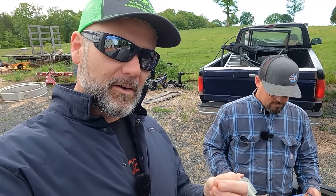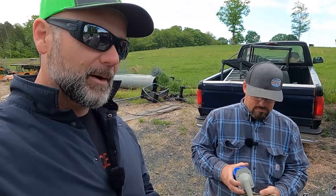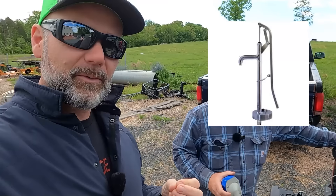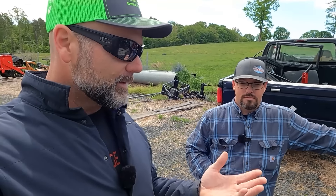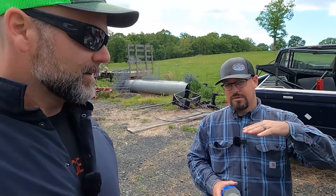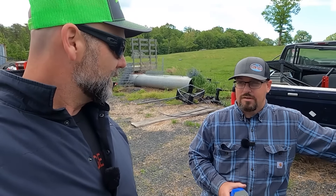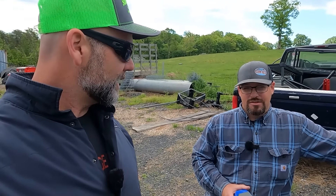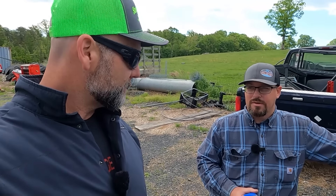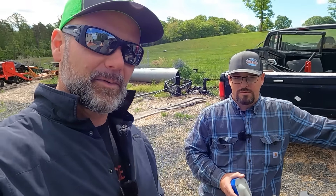The reason we need to know where the static water level is — we've got a bison pump going in. The bison pump is a stainless steel hand pump, so we never have to rely on electricity to run our well. We can always have a water source for our animals. Static water level is how far the water comes from the top of the ground down to the top of the water. That's where your water level is going to sit in the well. Will it fluctuate from summertime to wintertime? It should stay steady — unless you're using the water, then it'll go up and down.